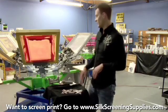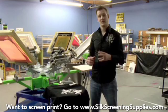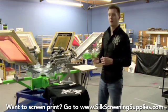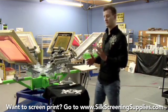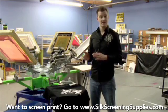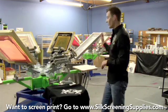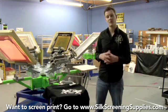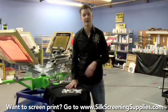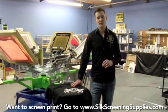One other thing to touch on — we did this print manually on a manual press with a manual squeegee, so you can physically control the angle and pressure. The first pass is pretty hard and straight, and the second one changes the angle to build up opacity. With an automatic press, you can't have that functionality since the squeegee pressure and angle is set on each head. What you can do on an automatic is use two different screens — one with a more up-and-down angle, flash it, then a couple stations later use another screen with a thicker stencil and a more angled, slightly softer stroke. So you can accomplish the same result with either automatic or manual printing. Thanks for watching — we hope this has taught you something and will help increase your production times and cut down on the three or four flashes you may currently be doing for white.